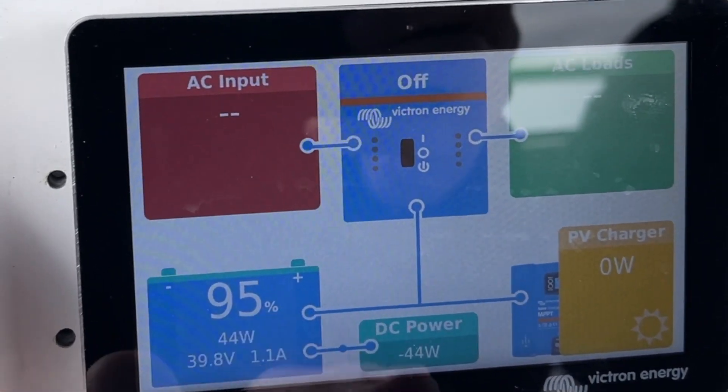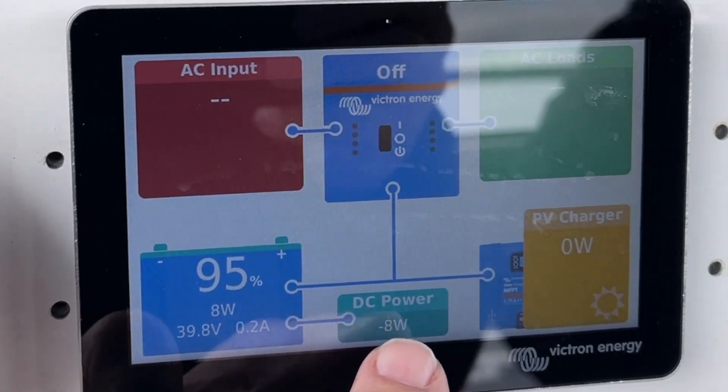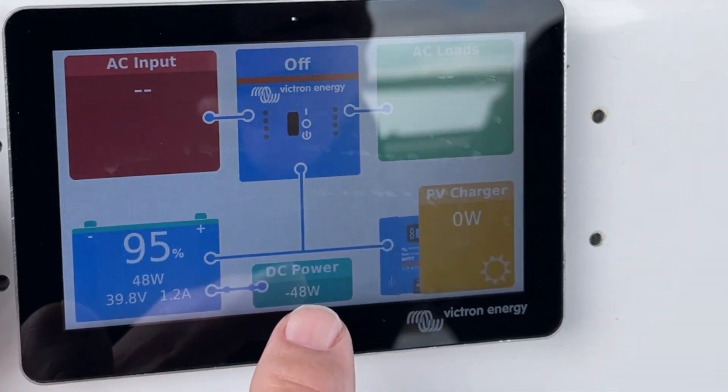Now the negative number here — you can see the charging. That's what we're doing at idle. Now what Scotty does is it won't in any way damage the alternator in the boat. It releases it at idle if the voltage drops below a set point, and I've set that at 13 volts. So let's take off.